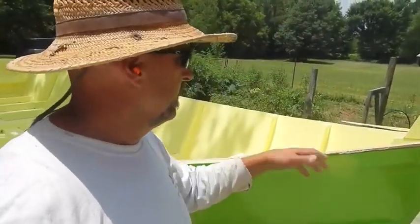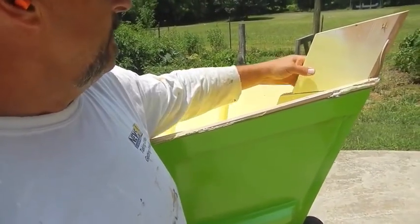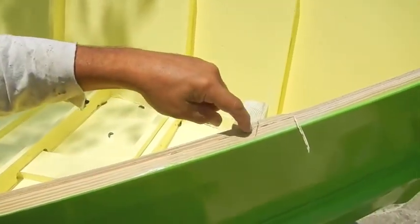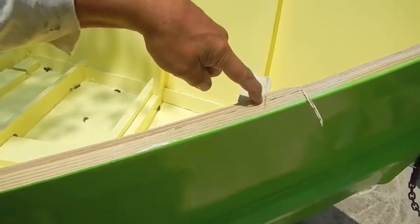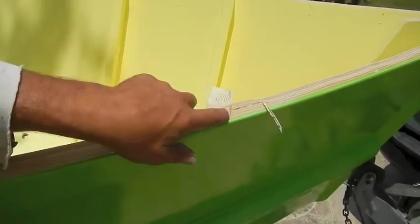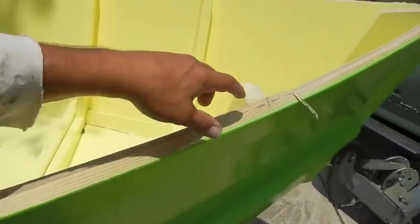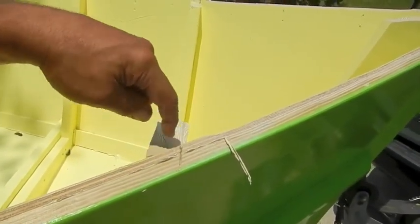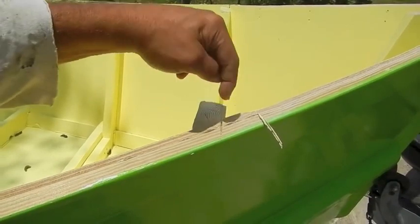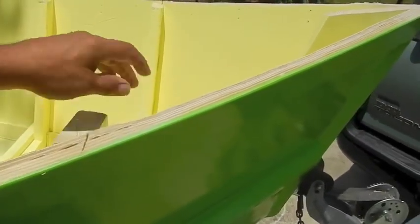I've already done it, but I had the bow stem on there and it was long, so I trimmed it off. I went in and cut fairing lines just like I did on the bottom on the shear clamp — cut in fairing lines from my outsides, my point of reference in this case because I'm going to cap it. I cut my front lines up front on this one and I'll taper down this two-by-four frame.